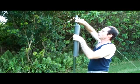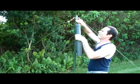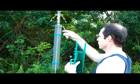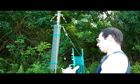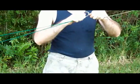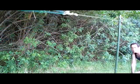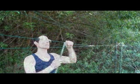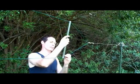To set up the antenna, clip the center body to the center mast. Clip the wire sets to the center body and unwind the wire. Clip on the end tensioner and adjust to take up the slack. Snap in the wire spreaders.